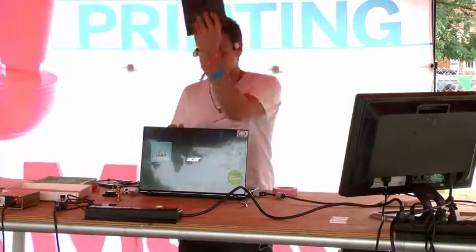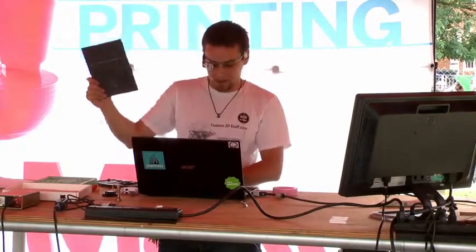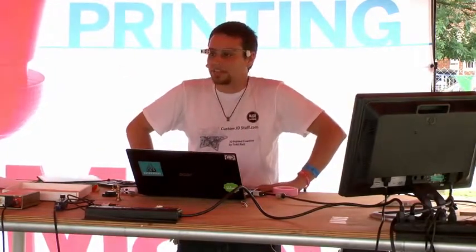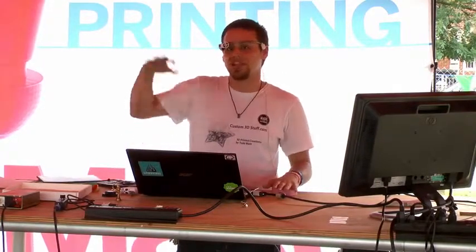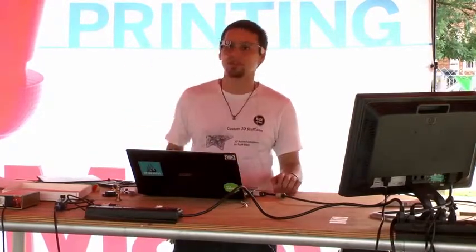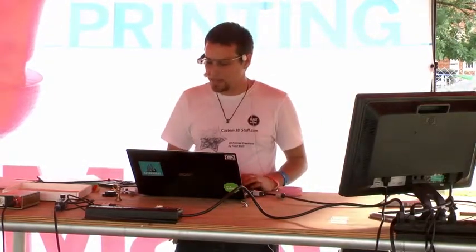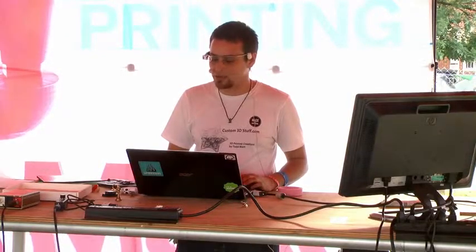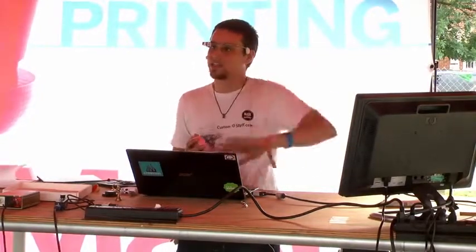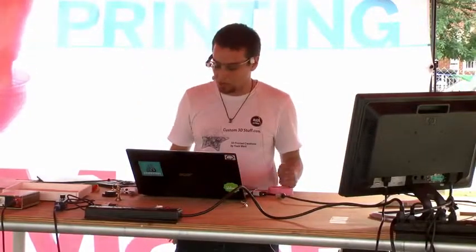Here it is — this was the original one, the first part out of the pink mold. Finally cured! We had the knobs and everything ready to go. There's the Mos Eisley Police Department — the website where all the Sand Troopers communicate and share their prop knowledge. We had a huge following because nobody had made this radio before. But on this first casting, can you see pink in the little holes there? The mold got pulled out — when you cast silicone you should spray mold release, but these little nubs got pulled out. So the mold broke and we had to make another one.